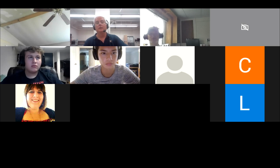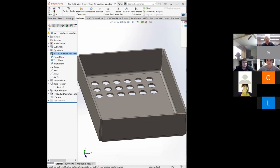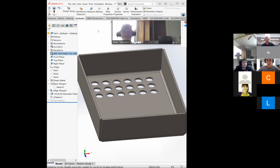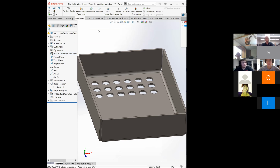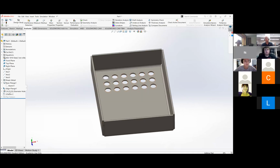Wait, so do I have to do a blind hole wizard instead of that extrude on the can? No, you can absolutely do an extrude. So you're talking the mouth opening? Yeah. So what I did is I cut extruded an ellipse. And there's nothing in the hole wizard that's going to give you an ellipse. But why would there be an ellipse when it's flat on the inside? Because you're going to do a shell and you're going to pierce through that mouth opening.